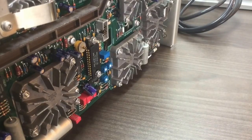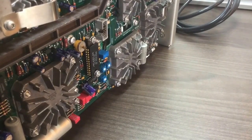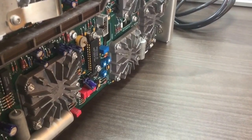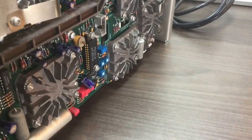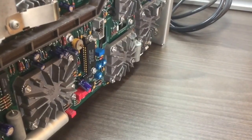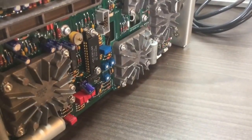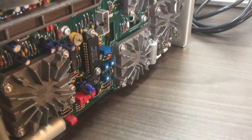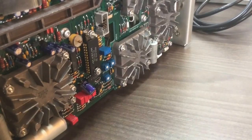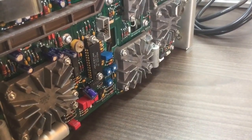When I had to remove the chip from the mainboard, I had to unfasten the nuts using a pair of pliers, which, at least in my opinion, I think caused a lot of stress on the circuit — and most importantly on the heatsink of the chip. I can only report the results and tell you that the scope works perfectly since I did this modification.